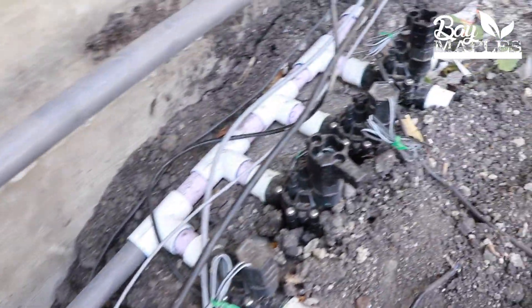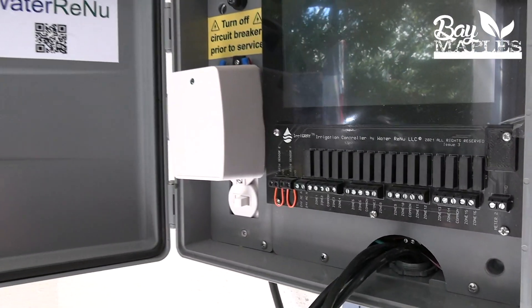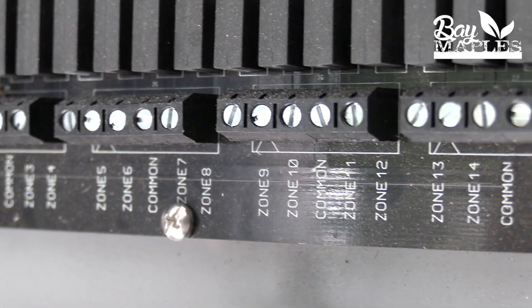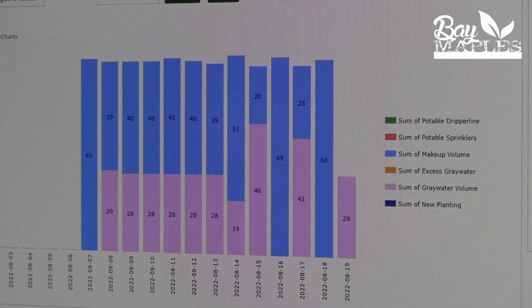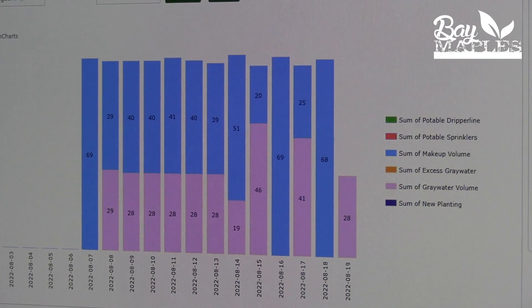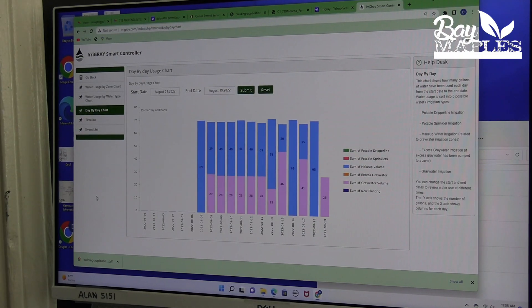This allows you to hook up to a smart controller that can set different zones for different irrigation schedules — every day, once a week, and so on. It can also connect to a potable system, so if you have raised vegetable beds or delicate plants you don't want to use gray water on, it can irrigate those zones on potable only. Or if there's no gray water available, it'll pull fresh water. You can even plumb a rainwater system — if you have a water cistern, it'll pull from that when it's available. So this is what they classify as a smart system, offering a wide variety of configurations, water usage options, scheduling, self-filtering — all in a very compact unit. That's why I'm a big fan of this particular system.